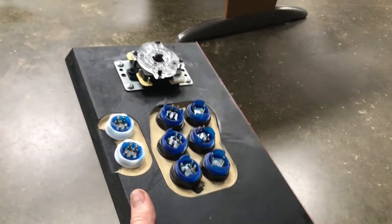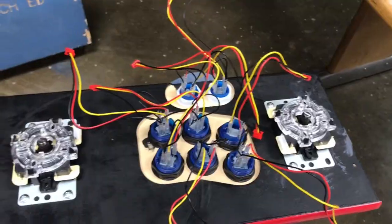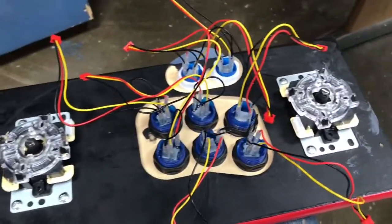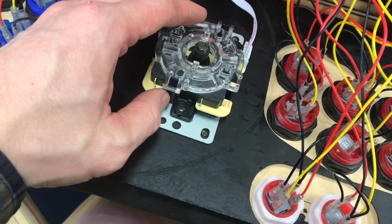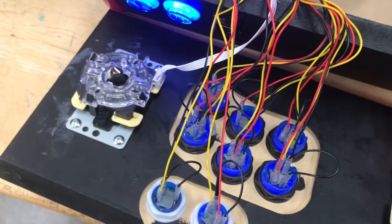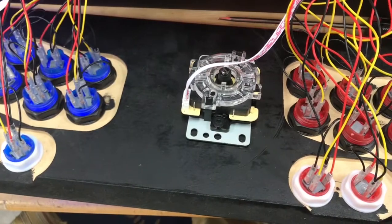Here you can see all my buttons installed on the underside of the control board. The wiring diagrams come with the buttons you buy — that button pack is about $60 and it's pretty easy to follow. Make sure the joystick is installed the right way, because your up becomes down and down becomes up and everything gets reversed. Everything plugs into a board and I just set the board inside. I also made the control board removable in case I ever needed to change or fix anything.